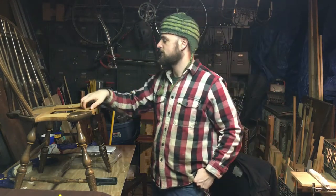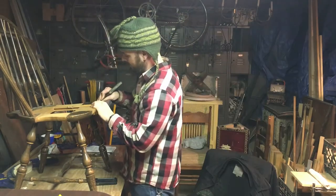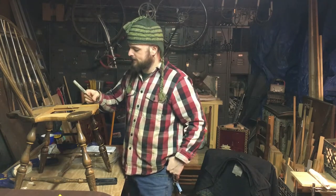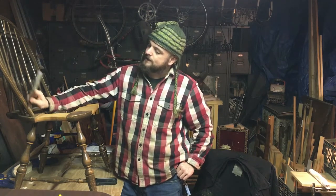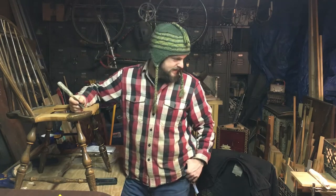I'll sand this out. I'm kind of curious what this stuff is — when it gets old it just comes right off. It's interesting that it's a different color than the wood beneath it, because when you put on a shellac it's clear and you just see the stained wood beneath. When you scrape off this stuff — maybe it's a stain — oh, they probably put on a tinted shellac, not a clear one. I know you can put dye into lacquer — I just never put it together that that's what's happening on a lot of these pieces. Lots of sanding today.